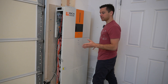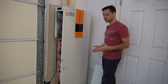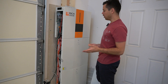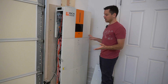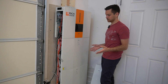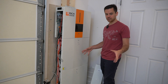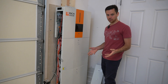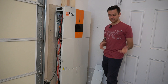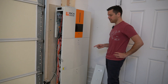Also, if you have two units in the split-phase configuration, they're going to have their own separate batteries, and I don't like that. With a server rack system, you have one large battery you can expand and then add more LV6548s when you need them. With this, you have to have two separate solar arrays charging each individual unit — and if one of them shuts down because it doesn't have enough battery, it's going to shut down all your 240-volt circuits. It's very similar to the EcoFlow Delta Pro, where if one battery shuts down, the 240-volt hub shuts down even if the other is fully charged — that's a massive disadvantage.